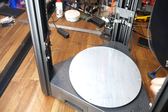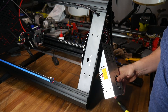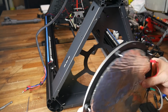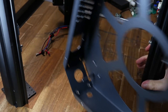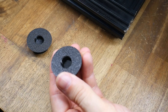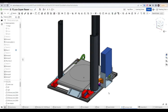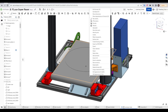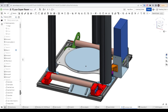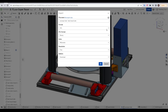After preparing all of the parts, the first step is to disassemble the base of the Super Racer. Obviously it should be unplugged with the power off, but apart from that it's pretty straightforward — simply keep undoing bolts until all of the individual components are released. Some of them, like the bed, you'll be reusing, but a lot of the parts, such as the sheet metal frame, we can put aside because we no longer need them. Once your printer looks like this, disassembly is done. Some of the printed parts have a false floor to avoid the need for support material. The holes in the tube caps need a 5mm drill bit to create the hole for the threaded rod. Anytime during this build, if you're unsure of a part, you can refer to the source CAD. This will let you see the way that the extrusions are placed, and to help visibility you can right-click on any part to hide it, as well as toggling part visibility by clicking the eyeball icon. You can also right-click and go to export for any of the parts, where you'll have the STL option as well as other formats if you'd like to do some editing. And you don't need an Onshape account to do any of this.